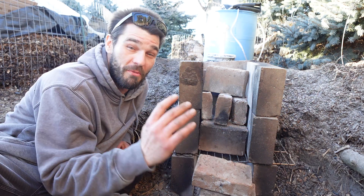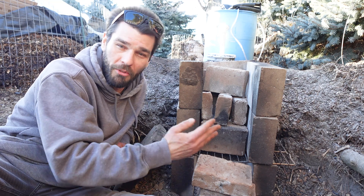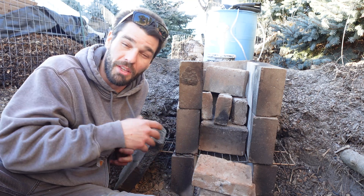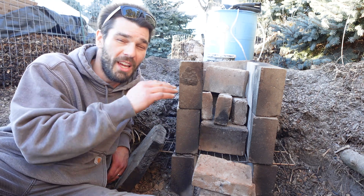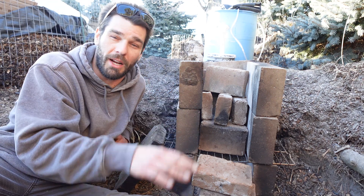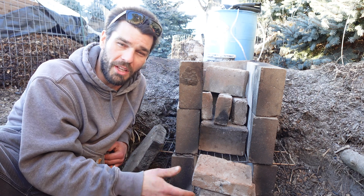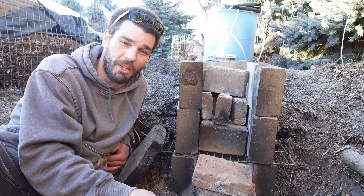This was very interesting for me — very cool to observe the entire process, all six steps taking place and forming right in front of my eyes. We've got a nice brick that is about a third of the weight it started at — we lost a ton of water mass and organic matter that was actually inside the brick. That is why we fire them: get them up to the right temperature, flash them, hold that temperature, and then slowly bring it down. These are going to dry out here till tomorrow, then we'll bring them inside the greenhouse and begin some foundry work, melting down aluminum. Thank you guys for watching.